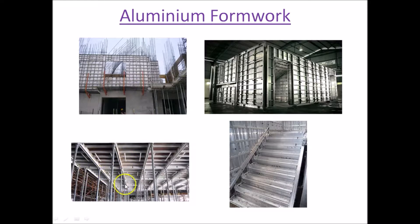In this photograph you can see the lower part of the slab where the props have been put. These are all designed for easy removal. Many times the formwork of the slab is removed while the props are left in position for a few more days until the slab gains the necessary strength.